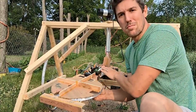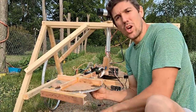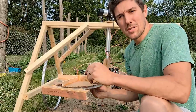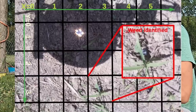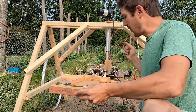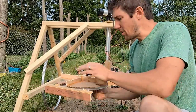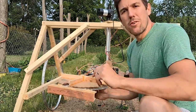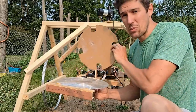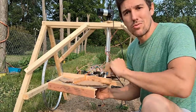The brain of this is a Raspberry Pi computer. The eyes are a Raspberry Pi camera pasted to the bottom side of this assembly, which get images of the ground directly below the lens. The brain is running a customized image classification model in TensorFlow, and when it sees a weed, it uses this motor and this motor to manipulate this big lens over the weed. Then it uses these three motors to focus the beam of light on that weed, and finally lifts the lid to paint the weed in burning sunlight. After clearing an area, it uses the wheels to move forward to the next area.